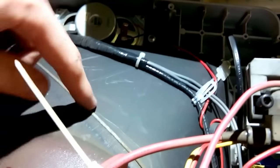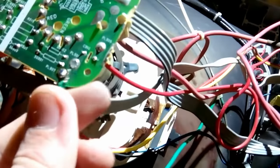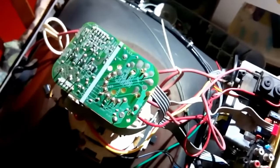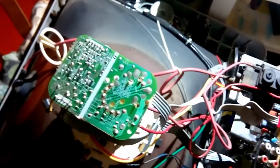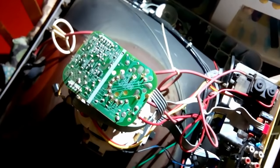Next, testing. Another quick tip. Sometimes you will have to desolder or disconnect the so-called CRT earth. It's basically this strap which connects the outer aquadag, which is gonna be ground. It should be connected to ground on the neck board, usually, in this set, by this wire. So, if you did desolder it, you must connect it back. Do not run the set without this, because like a famous sticker says, crap happens. Well, not crap, but another word, whatever. You catch my drift, I guess.